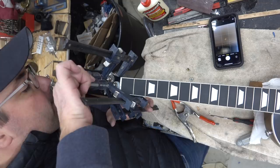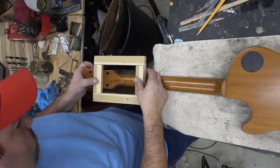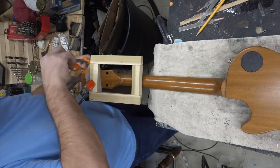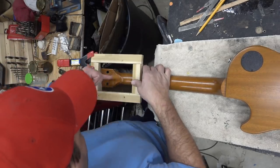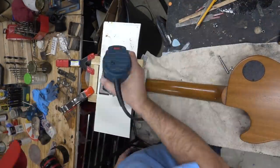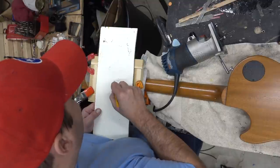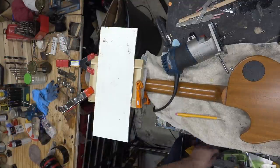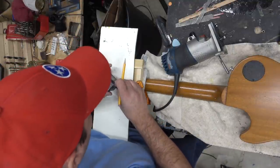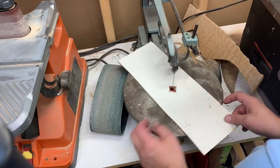I'm then only really missing one chunk off the back, and we're just gonna cut out a sort of square patch and replace that wood. I'm going to be using a Bosch router — I'll create a template using a quarter-inch upcut spiral bit and cut out the template. It's just a square. I actually did this twice — I did a one-inch square and I didn't like that, so I went a little bit bigger.